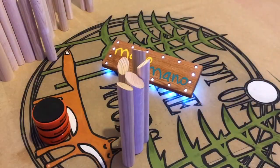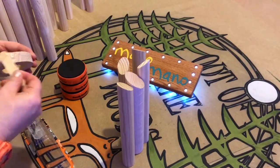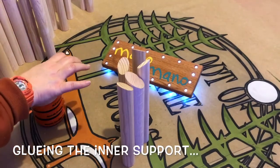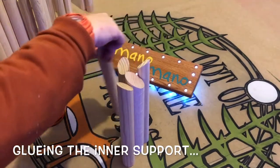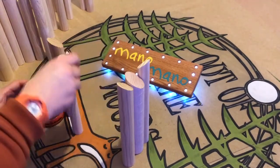Here I'm gluing up the central ring by mixing up some two-part Gorilla Glue epoxy. This inner ring will form an internal guide for the first ring of dowels. I set the ring at a predetermined height to ensure that the lamp bulb holder and the bulb itself will eventually nestle below the level of the shortest dowels.